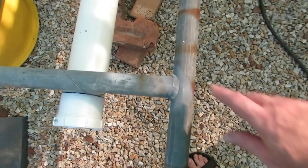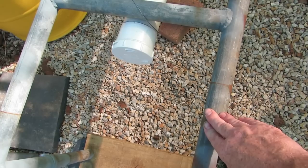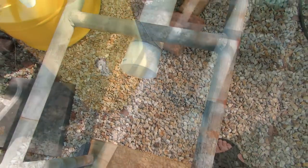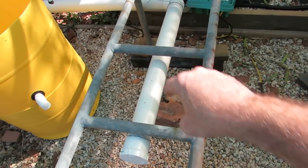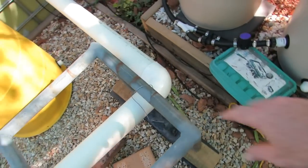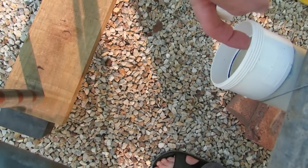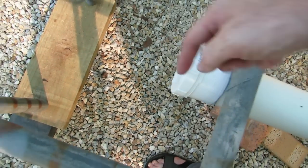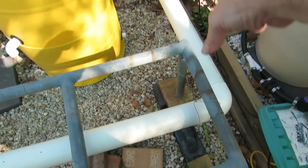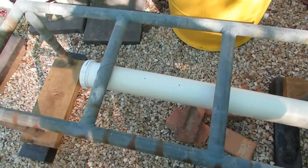A couple of cross rails put in situ — just to take the weight. This is inch and a half or inch and a quarter pipe, really heavy duty stuff. Just down the centre I've tentatively wired on the drain because I have to take it off to drill some holes and remove the swarf. There's a glued fitting with an open end directly into the sump, and on the end a threaded cap. These fittings can take another section of pipe, but I've got this option as a way to stick a hose down there and blow out any gunk that may accumulate.